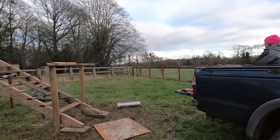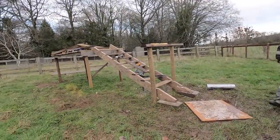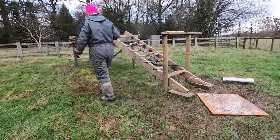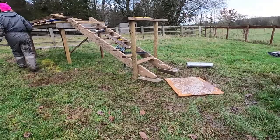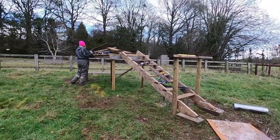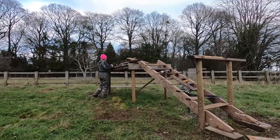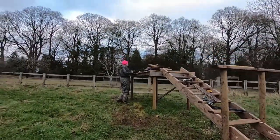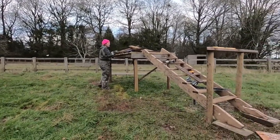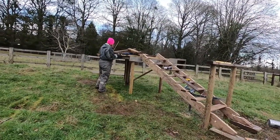It's the 28th, day after Boxing Day, 2021. We've got all the steps in. The jigsaw went flat on us on the very last one, which is a bit frustrating. I'm going to cut some bits of wood just to reinforce the underside for when we cut the hole through for the drop toilet. I've also put a couple of bracing pieces to stop the whole thing twisting, tied to the centre post.